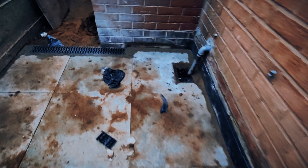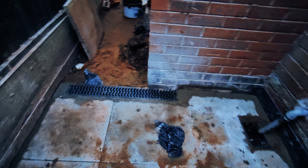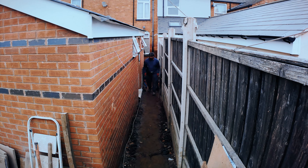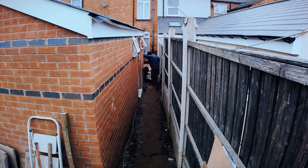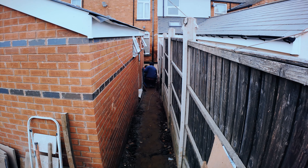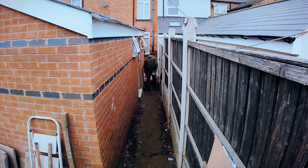You'll see a little bit of cementing around the drain pipe — this is sand here — and the drains, gutters, and gullies have been fixed. There's a little driveway drain because I left the long pathway as a slope, so all of this joins onto that long pathway which is about 12 to 13 slabs long — two-foot slabs each. The extension is on the left-hand side; you can see the new building, and the drainage will be added to that.